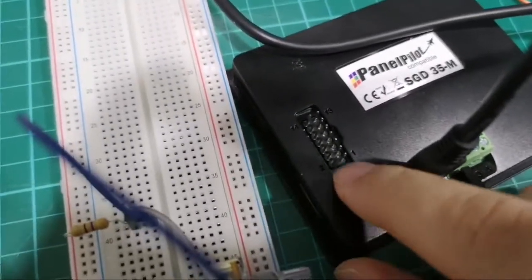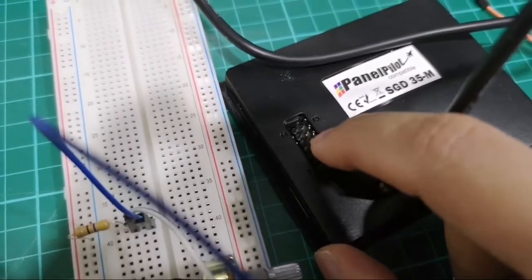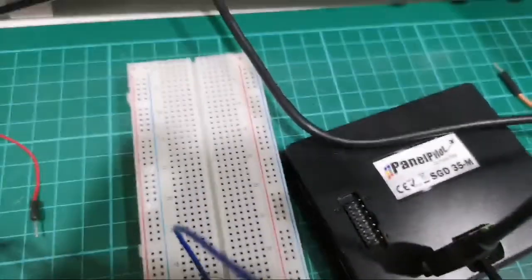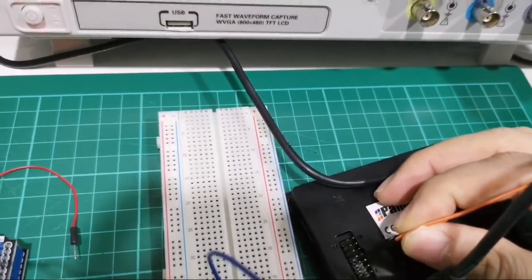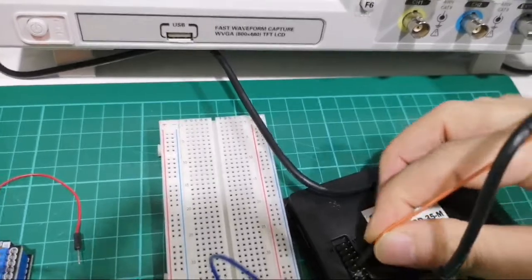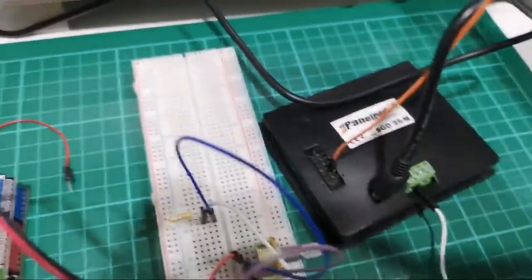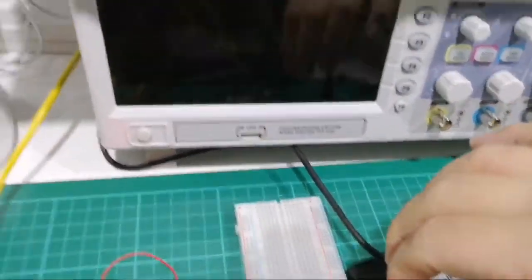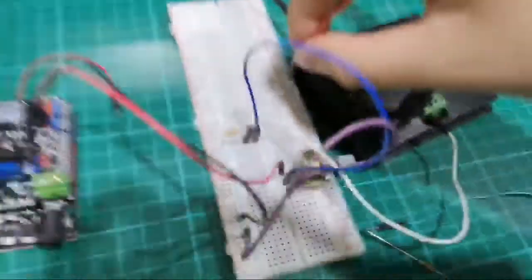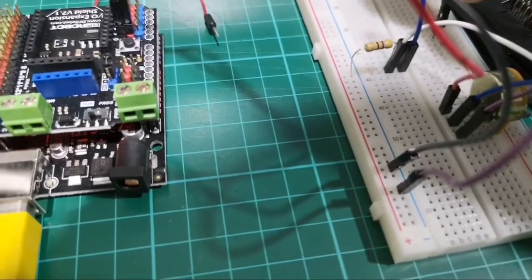All right, so the alarm ALM1, that's the pin. If you go to the data sheet, ALM is actually the column on the right, third pin from the bottom. Okay, so column on the right, third pin at the bottom, that's ALM1. So for ALM1, in this case, we are going to connect it to, okay, let's put it on the breadboard.